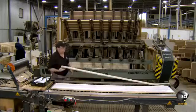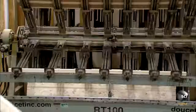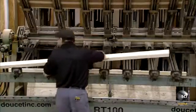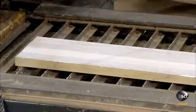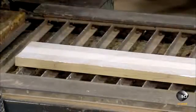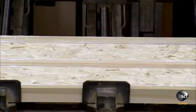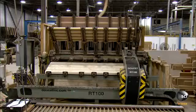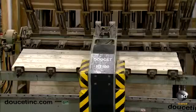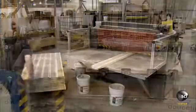Then they transfer the wood strips to the table of a clamping machine, repeatedly sandwiching one piece of linear strand lumber in between the glued sides of 2 solid wood strips. Linear strand lumber, LSL for short, is a piece of lumber made from glued wood fibers. A robot clamps the strips tightly to the LSL core. This assembly stays clamped on the machine for an hour for the glue to dry.